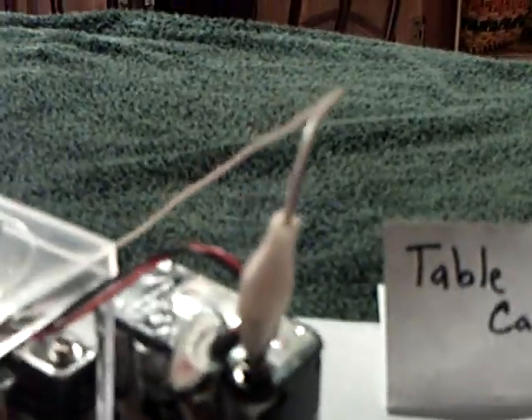The way I built this — let me turn the lights back up — I built it with an internal battery as well as an external source. Everything is inside there, including a 9-volt battery. If I plug this up to the 9-volt battery, I think I'm going to get at least 24 hours run time. Or I can hook it up to an external battery resource of any kind. With the voltage regulator right in there, I can dial this up or down to whatever amp draw I want, depending on the light that I want. This is what I've been looking for — something that was a combination of the best of both worlds.